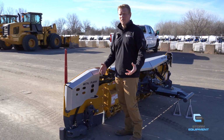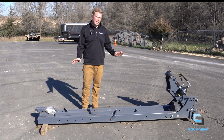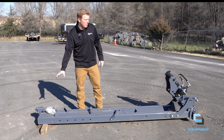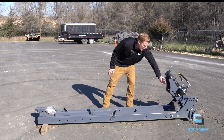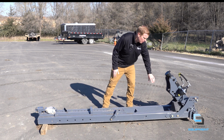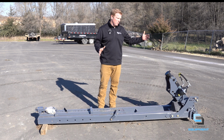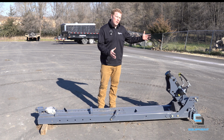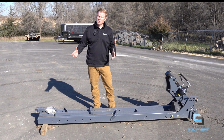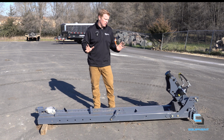Let's take a look at the undercarriage mount. This is the undercarriage mount for a metal Pless Agrimaxx. This goes underneath the tractor, ties into the drawbar, and then you have a tractor brand specific mounting plate that will mount on the front of your bumper to this lift cylinder. The nice thing about the undercarriage system is when the plow is pushing against the payload, all that weight is transferred to the bumper through the undercarriage into the drawbar. So you have a nice, steady, firm backing for your pushes.